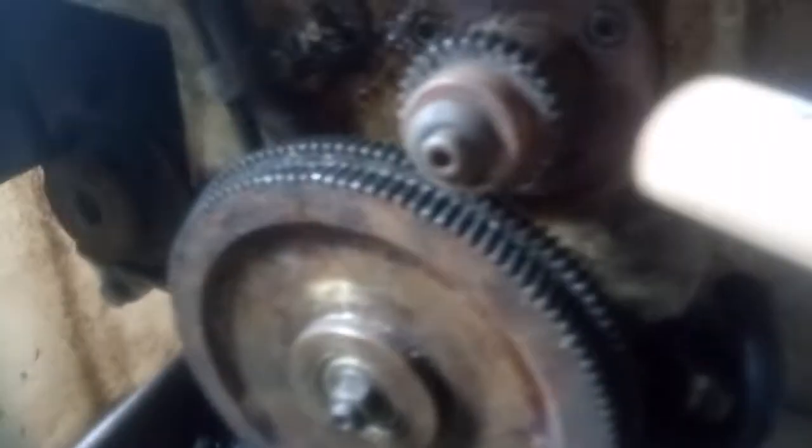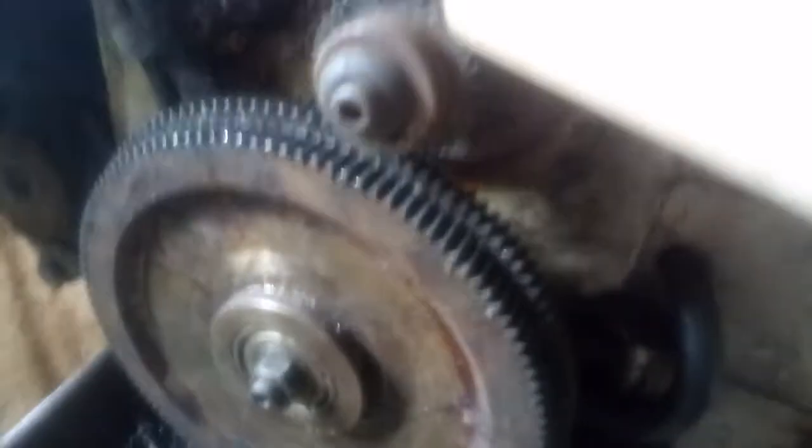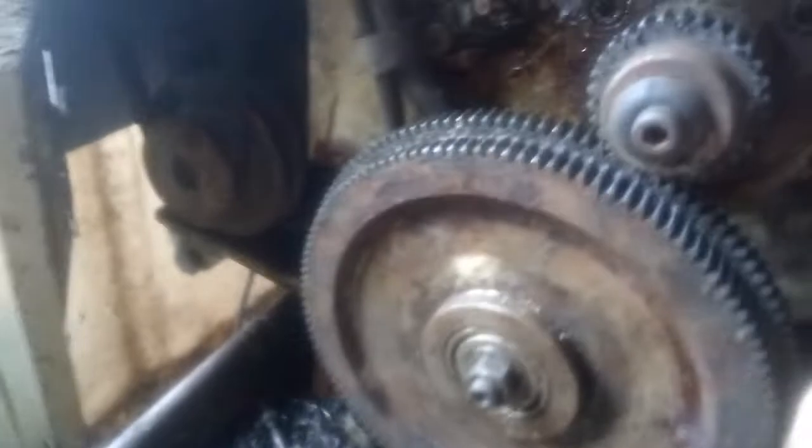So folks, what you've just seen there is the gear train. And that connects the mandrel, the spindle going around, which has a hole in it there to allow you to put stock in there. That connects it through this wheel here, which has either 30, 32 or 40 teeth per wheel on it, through an intermediary, and back to one here with 40. You can select whichever you want, depending on the scale or whatever thread you want.